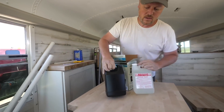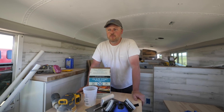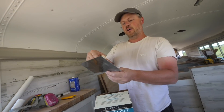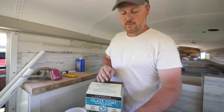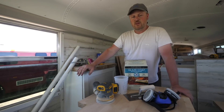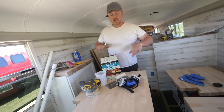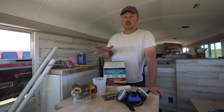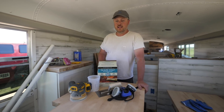Today I am doing epoxy. For those of you who follow our channel, you know that in our current bus we did an epoxy tabletop, and I've done some epoxy jobs since then. I've got my epoxy, my mixing cup, a trowel — this is a notched trowel, a 1/16th notch trowel, though I find using the flat side works really well. I've also got a respirator and a sander. I'm sanding this whole thing down with 150-grit sandpaper. I've got some plastic down on the floor because this stuff can get messy — epoxy will drip over the edges and make a big mess. Make sure to wear a respirator because this stuff really stinks.